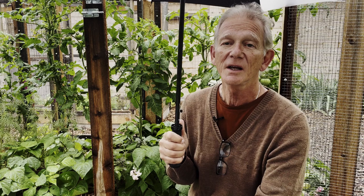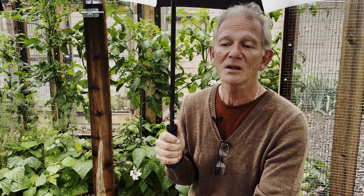On the previous bed, bed number 4, we built it all one structure after the other, the sides and then the roof and then sheathed the whole thing. Sheathing that roof with the hardware cloth in the air was a real problem, so we decided this time to use the existing bed as a template for the roof structure, build the roof on the ground, and then raise the roof into place and put the pillars in after the fact.